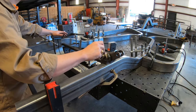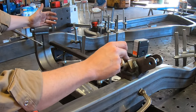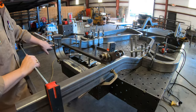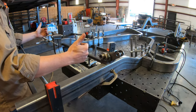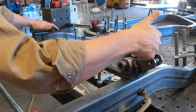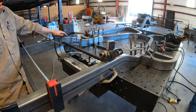We know there's a little twist in these, like that's 2/3 of a degree. So we can capture this one at 6 and then pull this guy forward to 6, because we have to do two things. We'll have to set this at the correct parallel, it's square. Pick one side. If this is 6, this one has to twist this way, so clockwise from your perspective. That should be easy enough, though. I don't think it's going to be hard. I've got some big pry bars, so it'll be real easy.